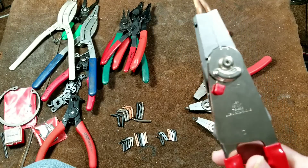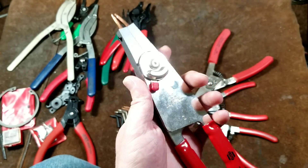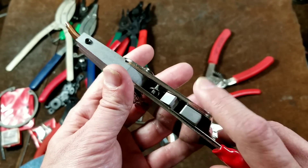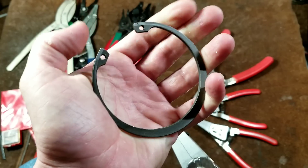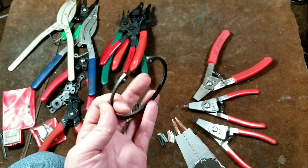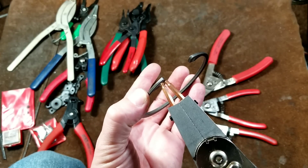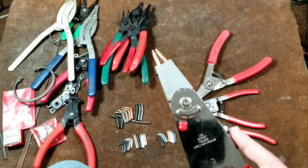This is the last one that I picked up. I've seen where they move this switch design to some of the smaller ones, but they just charge a huge amount of money. This would be the next evolution — made by the same company but these just have a flip switch. As far as reversing direction, they went from the push button to a switch, which is just no other way to make it easier. These large ones also intelligently are ratcheting, because large snap rings have a huge amount of force — I can squeeze super hard and I'm just going to end up hurting myself trying to compress this even a minimal amount. You have to be real careful, especially with large snap rings, that you get the pliers nice and parallel and try not to use ones with rounded tips, because one of these things popping off — especially as you're trying to pull it out of a bore — can really hurt, even if it doesn't hit you in the eye. That's especially why you need to wear safety glasses when working with snap rings.